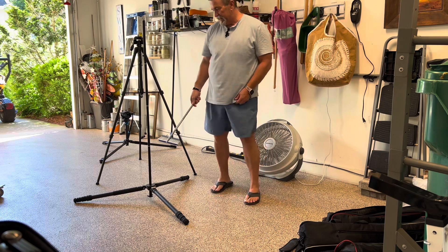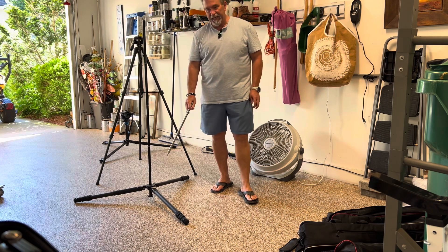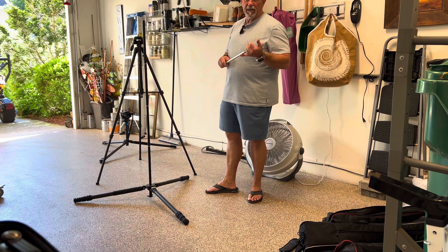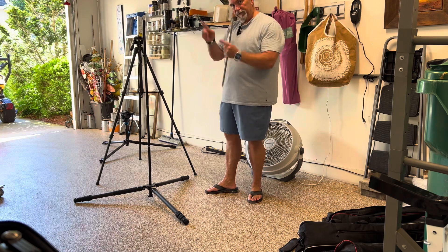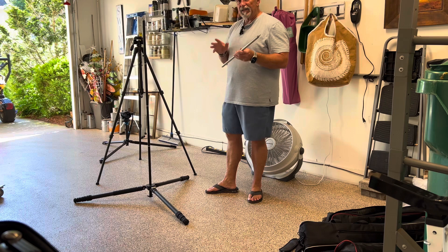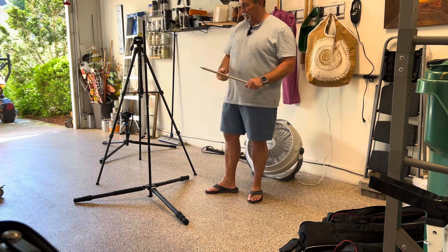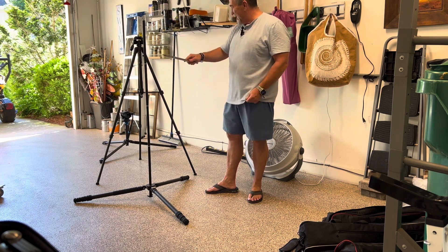The other thing I wanted to do is get a piece of PVC and a three-eighths nut and make a vertical stand so I can put the antennas I've made — the J-pole, the Yagis, and the stubby dual-band J-pole — on it and take it out somewhere to test with the NanoVNA, so I can tune and calibrate them on a stand where my body's electrical interference isn't screwing with the calibration.